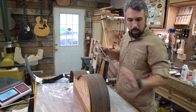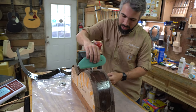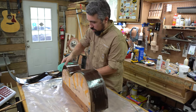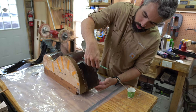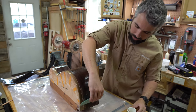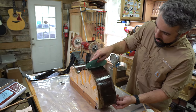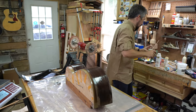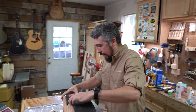I'll put some on this Indian rosewood inside piece as well. You can see how much more this piece is absorbing already. I just want to get epoxy on the center area — the goal is to apply just enough to get good glue joint contact between the two pieces. Not so much that it becomes a giant mess to clean up, but enough that you don't have any gaps. The slow epoxy means I don't have to be in a rush, which is key.